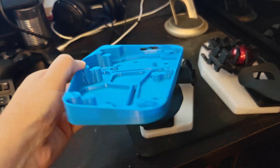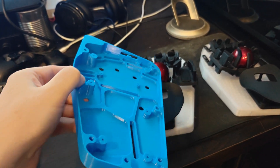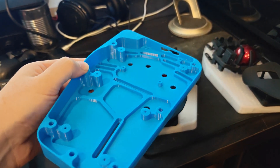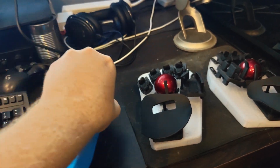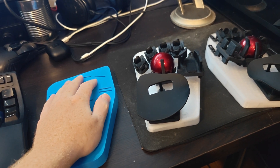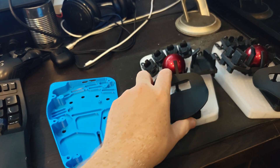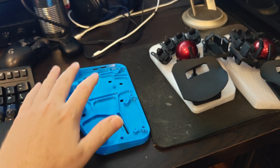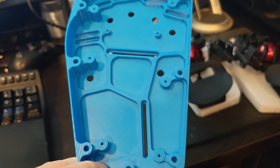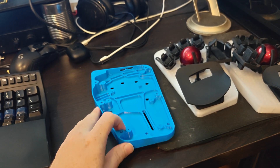This 3D print is just to check the design, and I'll transfer all the electronics and hardware into the prototype for a dry fit to make sure everything works. With the CNC version it's just one component — no longer two parts — basically the same shape, and I can machine it mostly in just one setup to get all the intricate details, with a second setup needed for one additional feature.